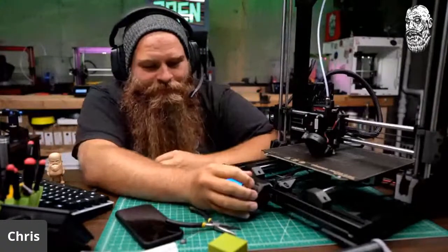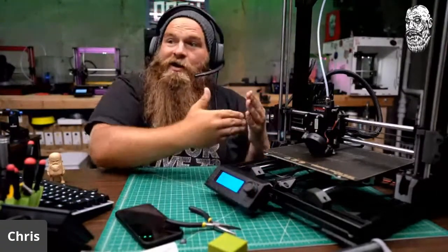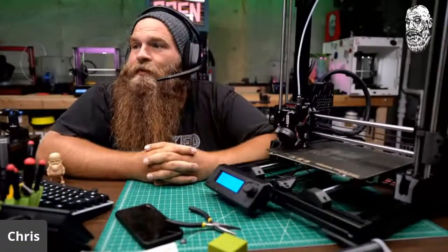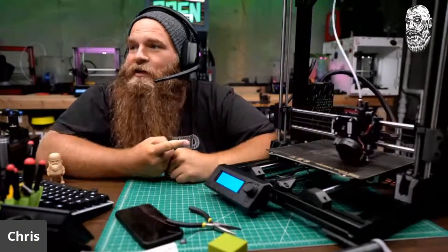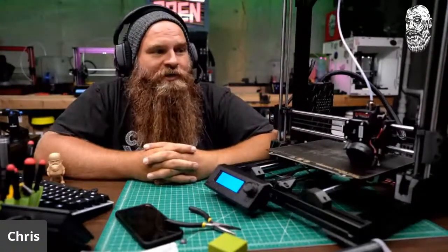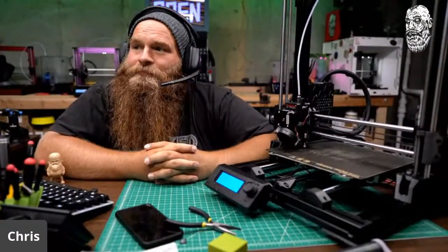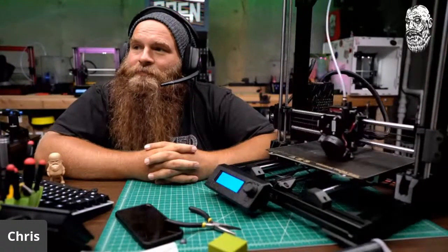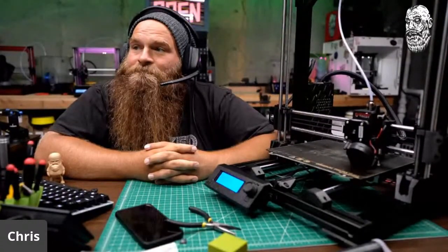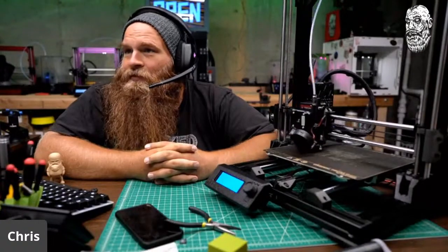Hey, bada bing. So let's do something else. Let's go to motion and let's go ahead and align the Z axis. So this is that thing I was talking about where it's going to probe on both sides. So let's make sure that works. It's going to probe this side, then the far side, and then it will fix any cattywampusness. Yep. That side was low. So it raised that side up. And I'll do that, I believe, 3 times. No, Dan. There we go.